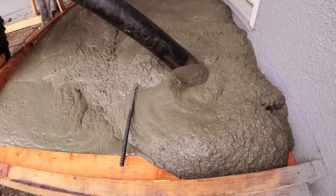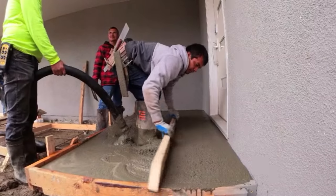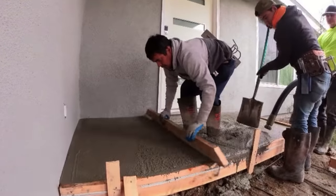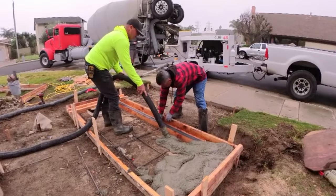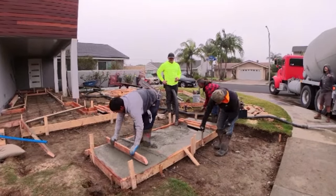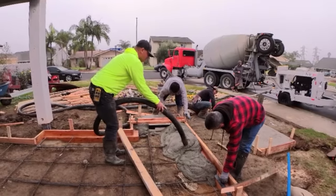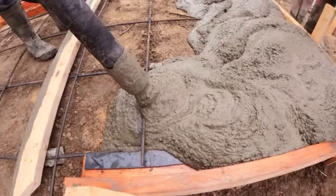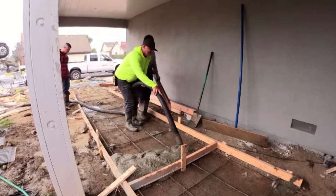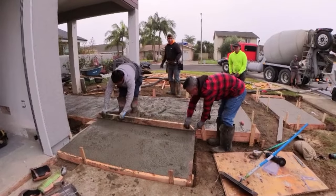The front porch wasn't originally cantilevered, so we just cantilevered it and the owner Ray liked it. John from Oceanfront Builders brought me out here — if you want a knowledgeable, reliable contractor for remodels and room additions I'll leave his number in the description. The angle iron is right there — Javier is holding it because it can't move. It has all-thread screws welded on at 45 degrees. We set it perfect on that edge so when we pull the two-by-four underneath, the one and a half inch angle iron is there so you can stick the lights up on it.